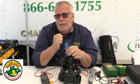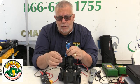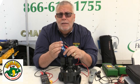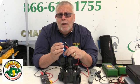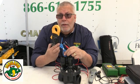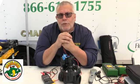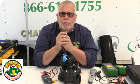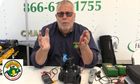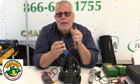Then you can work your way back to the clock to check it. Take one probe on the common, the other on the station, and hook two wire nuts onto this. If it doesn't have the same reading as at the valve, then you have a problem in the field — a loose wire nut, a bad connection from a gopher or a dog chewing the wires, or a broken line. If it shows open, that means someone cut the wire, a gopher chewed it, or somebody drove a stake through it during construction. If it's not an open, go to the valve and check the ohms there.